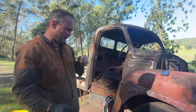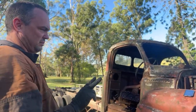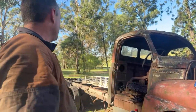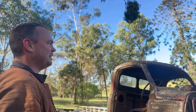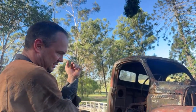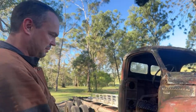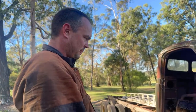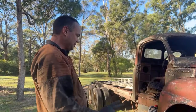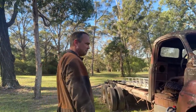So I'm going to try the porta power on the crank again because there's 4 caps still, but there's 2 that it's going to come away from, so you're only going to be pushing on 2, which may help. Then I'll get up the top and shock them. With the caps off, it's not trying to pull those ones down as well as push the other ones up. Initially it was 6 connected to it when I tried before. Now there's only 2, so we'll see what happens there first while I've got it set up before I pack it up.